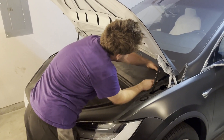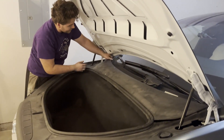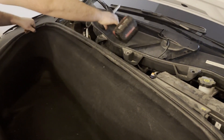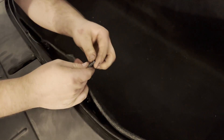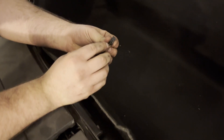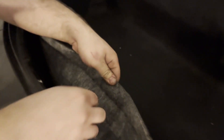So we've got four pops right here up there, one in the middle — five pops. Pull this whole interior out, weather stripping. Wire harness for the front lights — this one's broken but there's a little release tab right here, small, you can probably catch your fingernail on it, and then you just pull it right off.